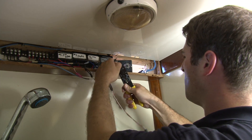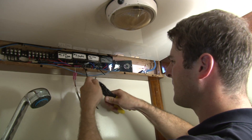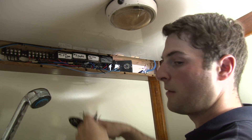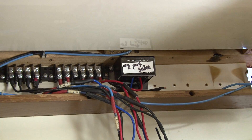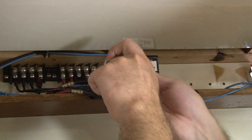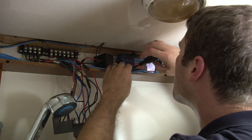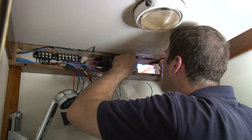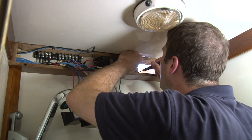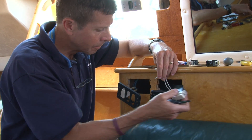We're just going to cut away these wires going into the control knobs so they can be removed. Our dimmer controls its load without dissipating nearly as much heat, and the load is going to be much smaller. On this 24-volt system, those middle circuit lights — if they were 20-watt bulbs — that's just shy of an amp each, so about four amps that all those conductors are carrying. That'll be reduced to less than an amp with the new lights.